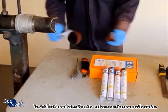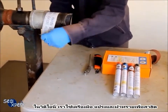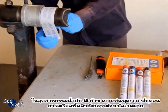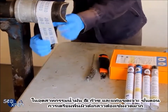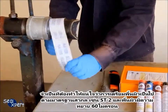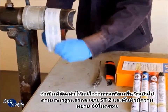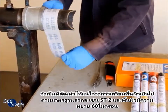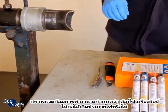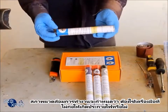In this video, we are using hand tools — a wire brush and sand belt — for illustration purposes. In the oil and gas and offshore industry, surface preparation follows more stringent requirements. It is necessary to ensure prepared surfaces comply to international standards, for example ST2 and surface profile to 60 microns roughness. Depending on the environment where the work is carried out, a spark-free tool may be required.